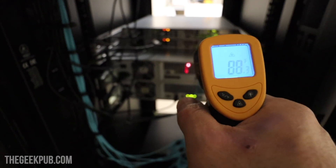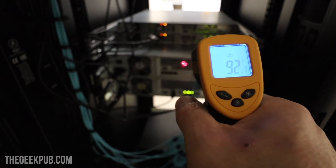I don't think we need anything that big — I'd call that active cooling, and I don't think we need active cooling in the server room. Coming out of the back of the servers is roughly 90 to 95 degrees at any given time, so the room will rise to 95 degrees pretty easily, sometimes 98 or 99 degrees due to ambient heat stored in the walls. We already have an air conditioning system for the entire building that's more than capable of keeping the server room cool — we just don't want to run it all the time. The simplest solution is just to get the heat out of there through exhausting hot air.